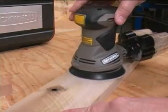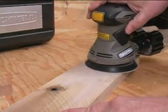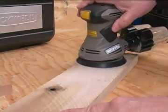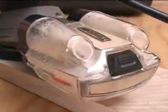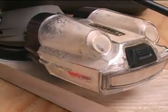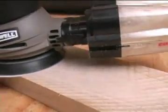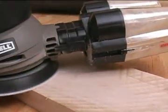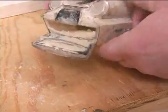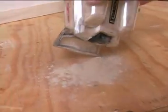I first used the Rockwell sander on a piece of rough-cut poplar. They give you one 120-grit and one 80-grit disc, so I put the 80-grit on just to show that this dust collection really wouldn't work. Static makes the dust cling to the sides of the box, so you really can't see what's going on. After sanding for a few minutes, I noticed there's no dust coming out of the exhaust ports on the front of the dust box. Here's where I was going to prove that the cyclonic deal doesn't work — except it does work, and it works very well.